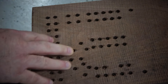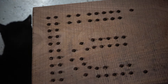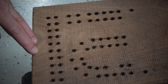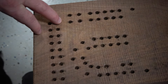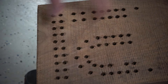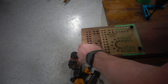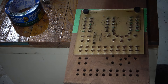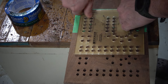On my initial pine run-through I had a lot of tear-out, and I'm still seeing some tear-out on the walnut right here and here. I've given this quite a bit of thought on how to minimize that. What I'm going to do is put a bunch of painter's tape over the top and see if that will minimize our tear-out. So I'm going to try this template one more series and if I continue to see tear-out after doing that, I'm going to give Rockler a call.